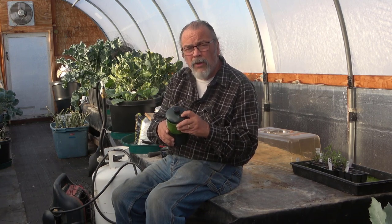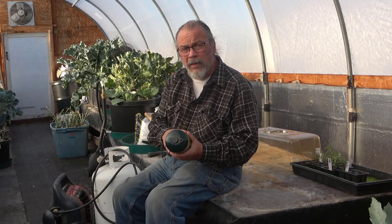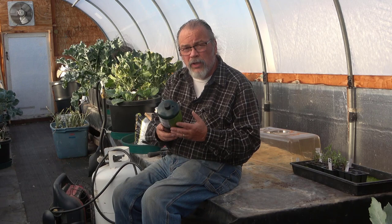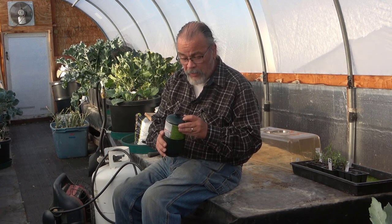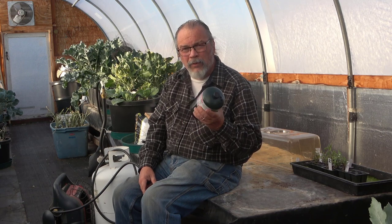There's also a pressure relief valve on the top. If you insist on refilling these cylinders, you can do it — there are gizmos and gadgets available through a lot of sources that will help you put propane back into one of these cylinders. But I'm not going to tell you how, because it's against the rules and it can be dangerous. If you're going to refill this, you want to make sure you don't overfill it — you need a digital scale, the right connections, and you have to really know what you're doing. These safety relief valves can let go spontaneously after being used multiple times, and then you end up with a propane bomb. If you have a pound of propane in the cylinder and the pressure relief valve goes off, you're going to have a pound of propane filling up whatever space you're in.